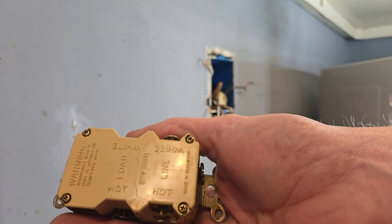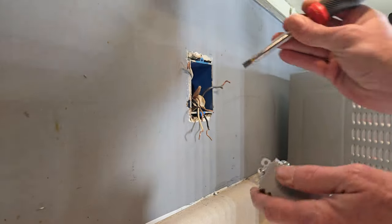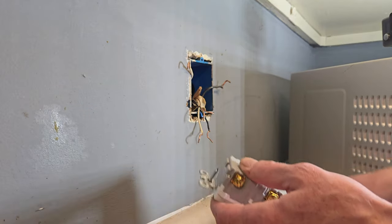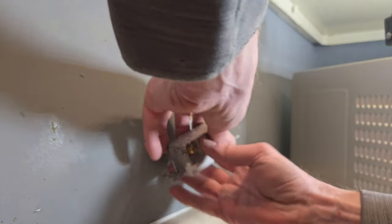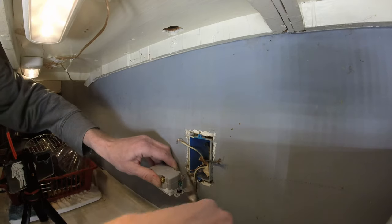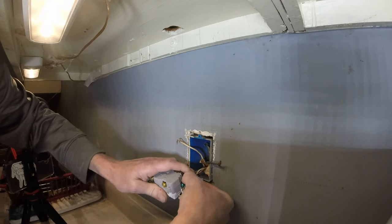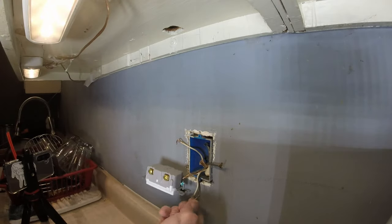You can see 'load' and 'line' on the new outlet. I'm loosening these screws and I'm going to undo the shepherd hooks on those, maybe nip them down a little, because these are the newer style where you can just push the wire behind that flat tab portion. We've got two ground wires to shove underneath that tab. It gets a little tricky — you kind of have to do it upside down because the tab wants to go the other way. Bend that around a little, get on both sides of that tab.